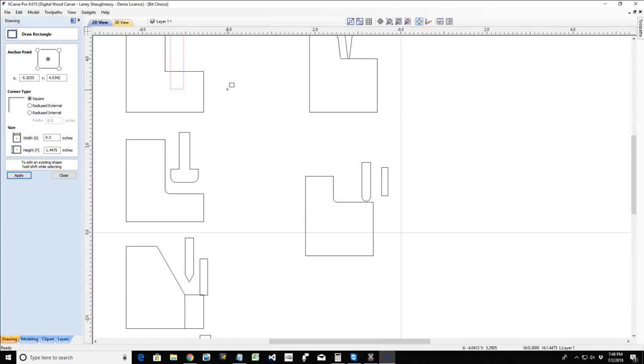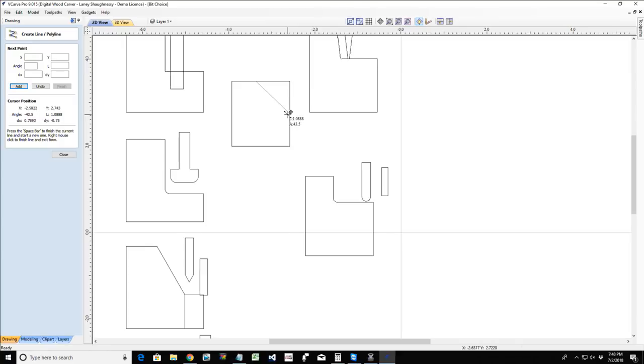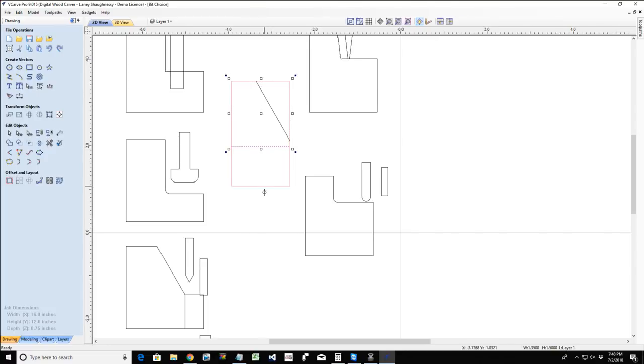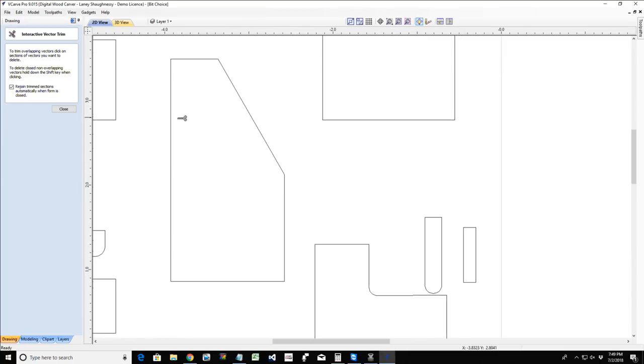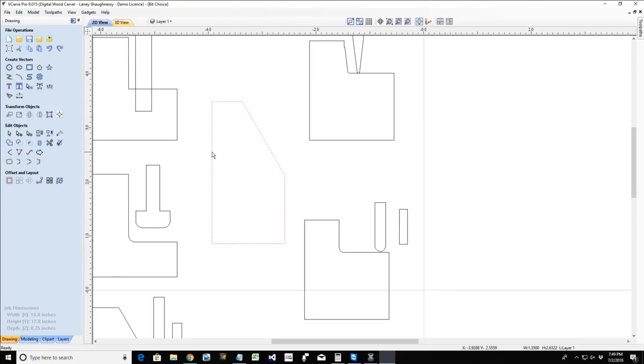But what if I want my cut to have a chamfered wall, kind of an angled wall? Bear with me a second. What if I want to cut this part out, but I want a nice chamfer around the edge, a nice angle cut? The angle is going to be dependent on, of course, the bits, 90, 60, what have you. But I want that nice chamfer cut. Well, then I'm going to run two profile cuts. One is going to be using my end mill to cut all the way through the material, depending on what the length of the bit is.